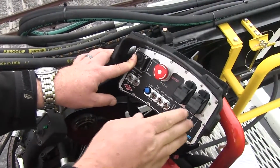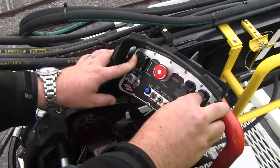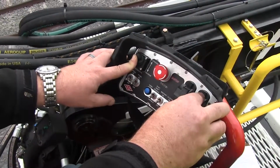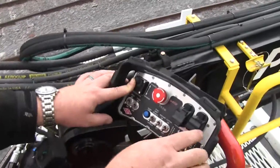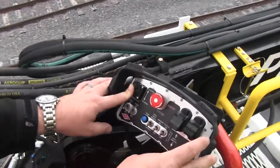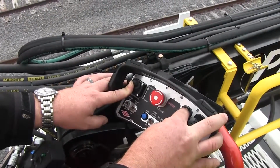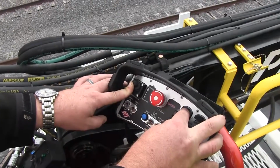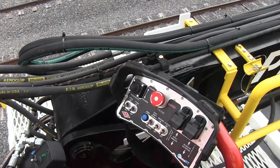The throttle and service brakes can be adjusted as needed while the vehicle is moving. To stop, simply release the transmission joystick and return it to the center position. The parking brake will automatically apply. The clutch will actuate while the transmission lever in the cab is returned to neutral. The service brakes can be applied if needed to help stop the vehicle. Release them again after the vehicle comes to a stop.